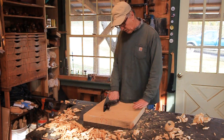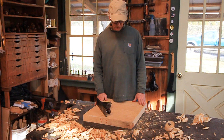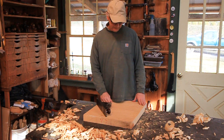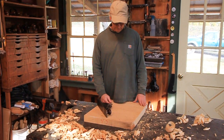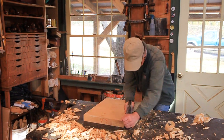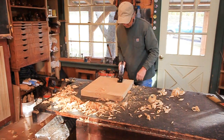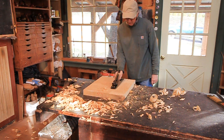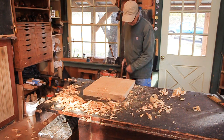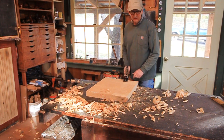Same thing — cross grain, you can take deep cuts. Then I'll turn and go with the long wood fibers to get a little smoother, and probably back off on the depth a bit to get a smooth cut. Just smooth enough for the spindle deck — smooth enough for the chair. If you notice, I either pick the plane up so I don't drag it back on the blade, or I tilt it so the blade doesn't get dragged back. I guess that's supposed to dull the blade — I don't know that for sure, but I've just developed that habit.